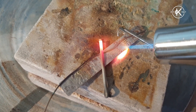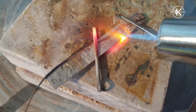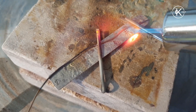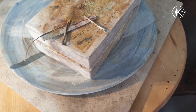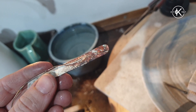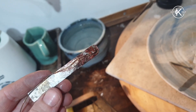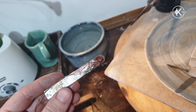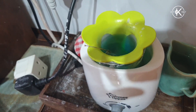That one little bit of solder's gone, so I'm going to move down to this area now. That bit's gone. That bit's gone. And that bit's gone. There you go — that's it being cooled, and you can see how disgusting it looks at the minute. That's one of the big things about silversmithing — I always tell people don't be put off during the process, because until you give everything the final sand and polish everything tends to look kinda manky. All this needs is a good clean in the pickle and then a bit of a file and sand.